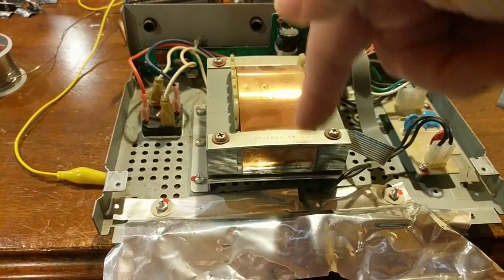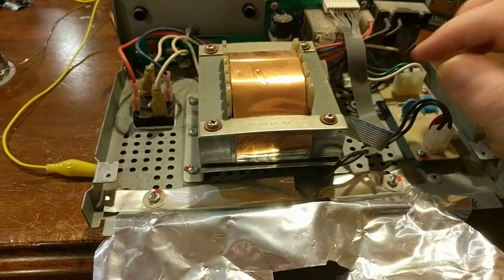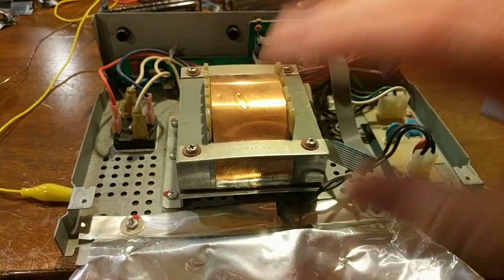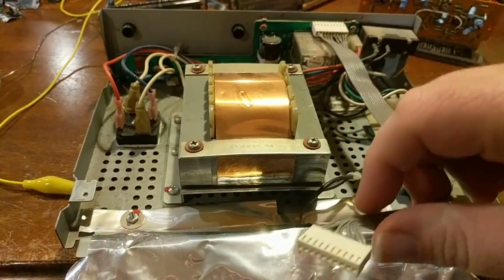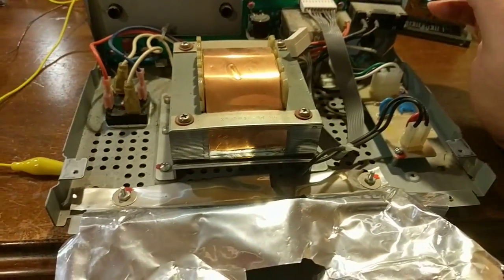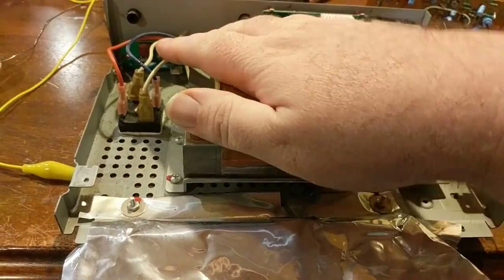And that will have the DC-DC converters, the op-amp circuitry, the standby microcontroller, everything necessary to make this thing function outside the Raspberry Pi. Plus, I need to put the audio power amplifier circuit in here somewhere too. So, yep, this transformer and all that stuff, I don't know what the voltage output is on it, but it's not going to work for what I need, so it's got to go.